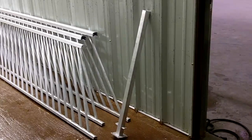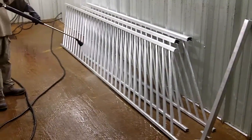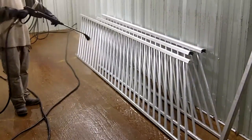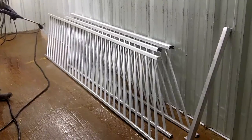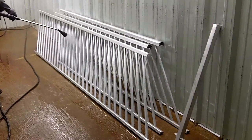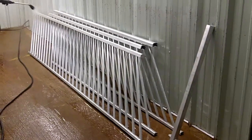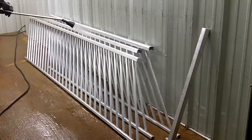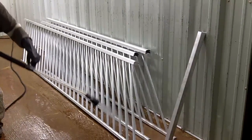We have finished manufacturing our aluminum, and what we do now is bring it into our pre-treatment area. To pre-treat aluminum, we have in our facility a five-stage pre-treatment — five stages being to go through a clean and etch with rinses in between, and then we have a sealer. As you can see here, we are rinsing the aluminum right now, ready to go into the cleaning stage.